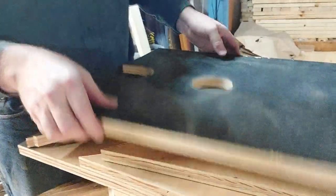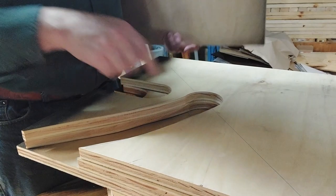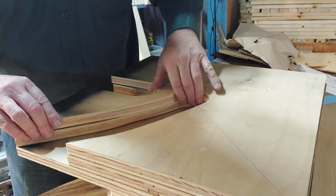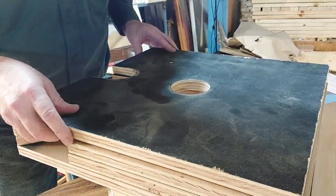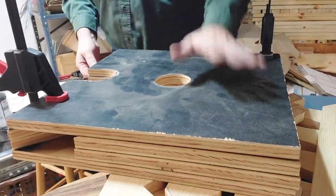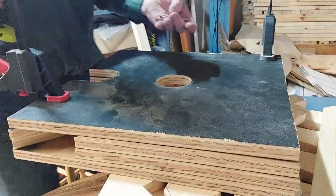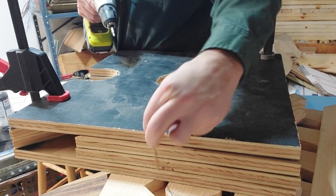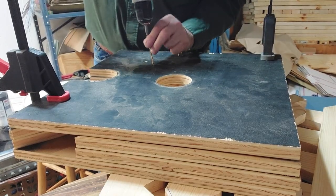You need to make sure you stack these up right, so we've got our two pieces here. We can line those up with that cutout just like that, come in here and line this one up the same way. Then we're going to bring this one and line it up the same way on top. Little clamps on here. We're going to go get some screws put in here, and we're going to put a bolt — the bolt goes to the table. In case we don't quite have screws long enough — you can see how that isn't going to make it all the way through — we'll be able to put them from both sides. We're just going to come in here a ways away from our center line and put our screws.